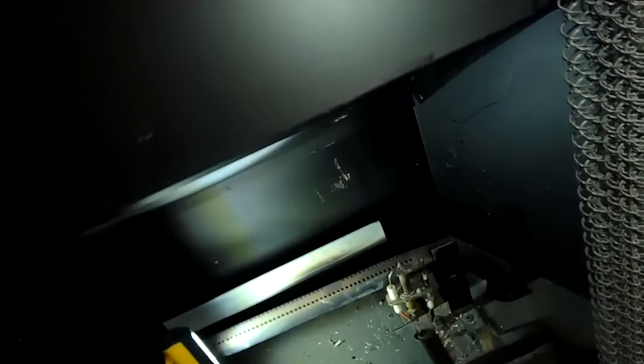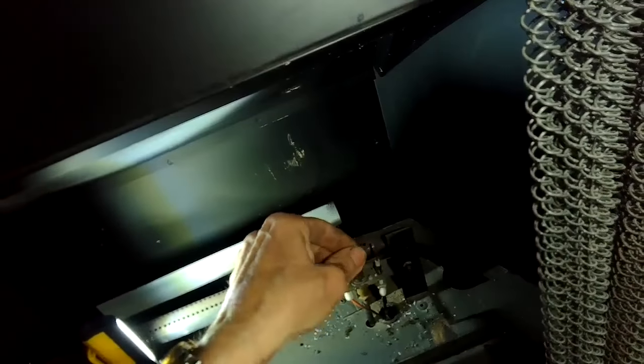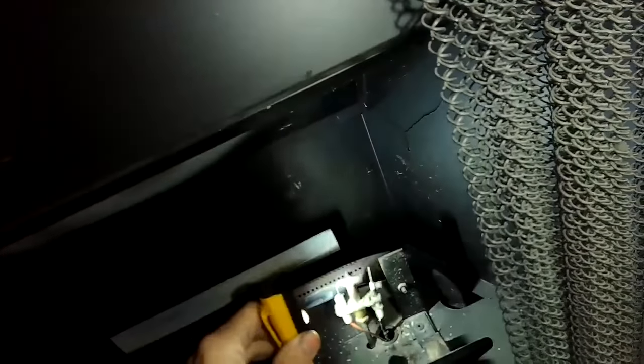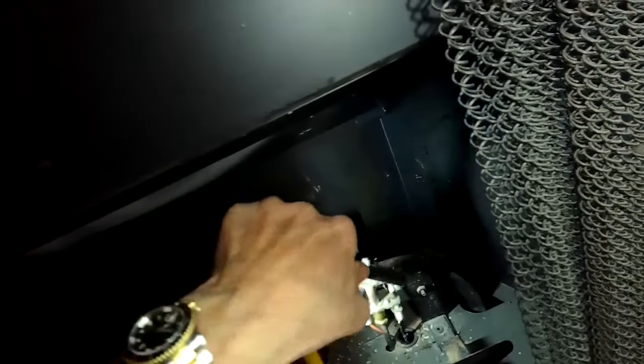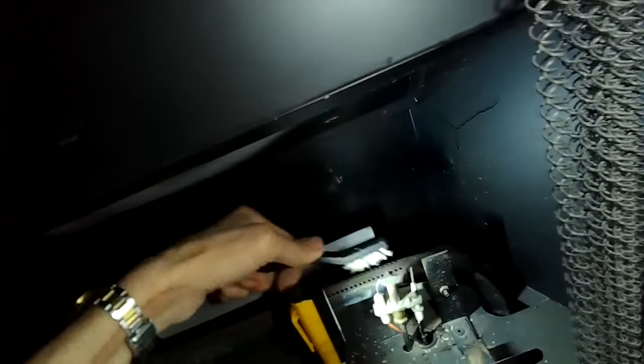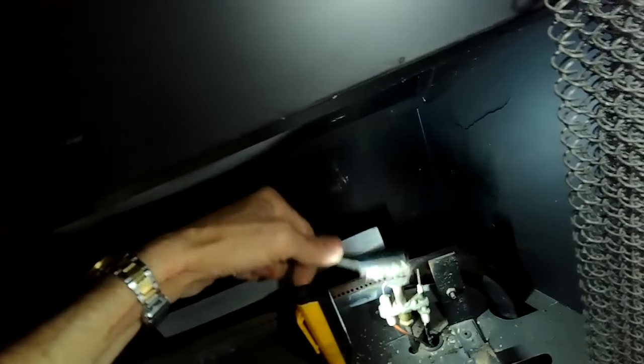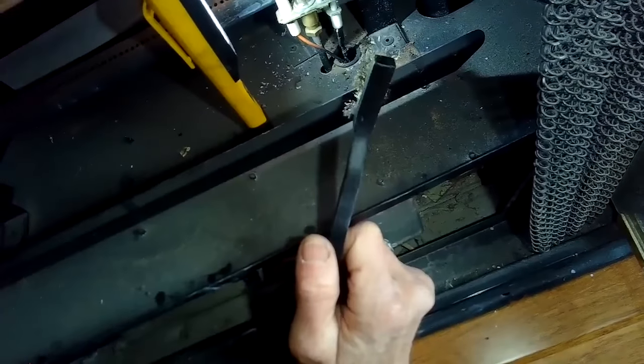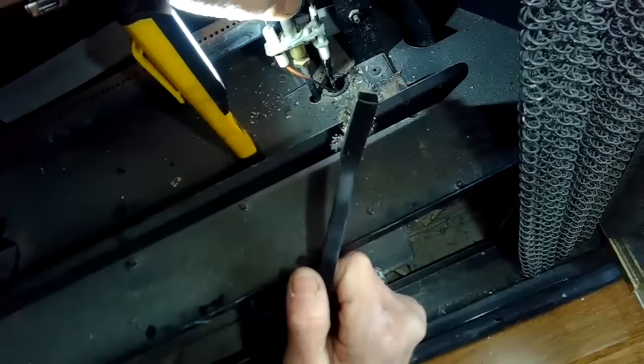I'm removing that other log to give me a little more room to work, doing more cleaning with the wire brush. Then I'll try to get something sharp and pointy to push into the hole where the gas comes out just to make sure it's not obstructed. You want to be careful not to enlarge the hole — you want something pretty skinny. It's a very small hole, so even a straightened toothpick would probably be too thick to fit inside that little gas jet.